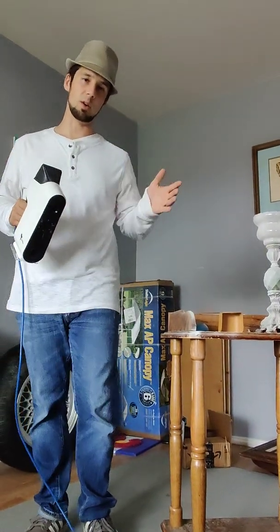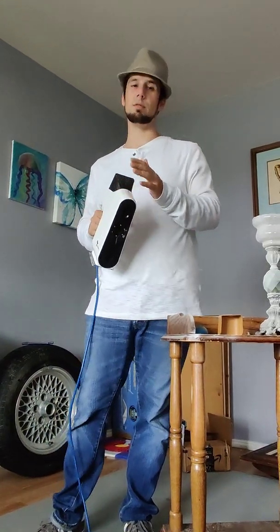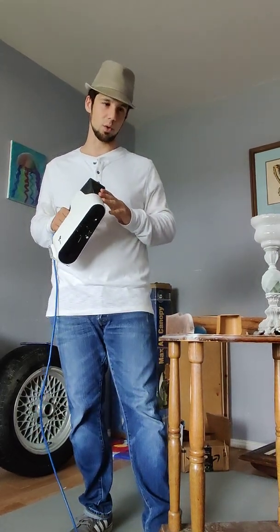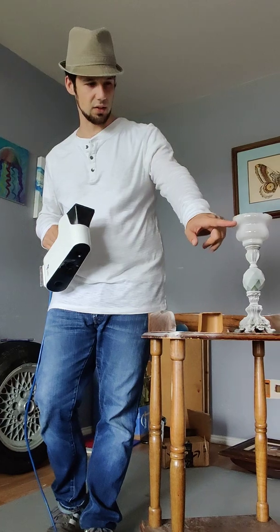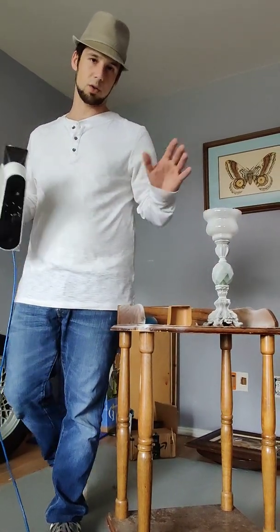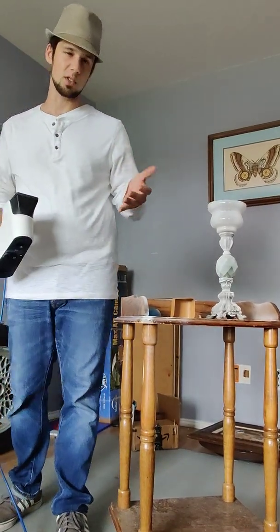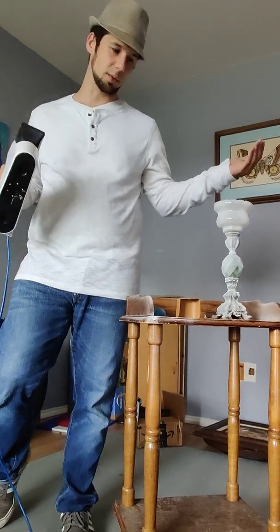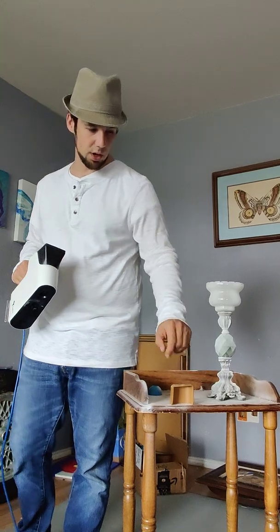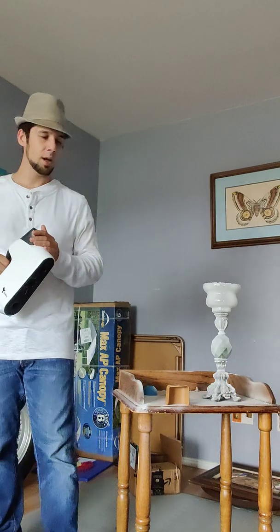First off, we'll be staying away from super shiny or reflective surfaces. Now this thing's actually pretty good at some reflective surfaces, and I'll show you as an example of this rim over here. I was quite impressed with the results. But in an instance where we're going to scan some glass here, the transparent glass, we definitely want to use some of this foot powder. So that's one of the big tips there, is get some of that Gold Bond unscented foot powder. The scented will have eucalyptus in it. If you like eucalyptus, go ahead, but otherwise, that can be a little strong. But you want to spray that all over the model, and that will give you a really good matte surface that this thing picks up.